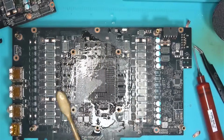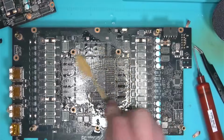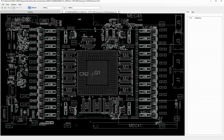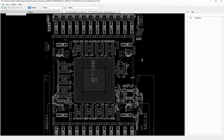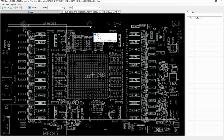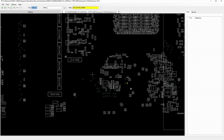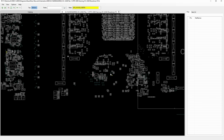Board is prepared, and before I power it on without the memory and the core, I want to see if the board itself works. To do that, I gotta make sure that I am reading 100 ohms in a very specific area. There are two places where we can check that: directly under where the core would be, or on the back on one of these 4 test pads.